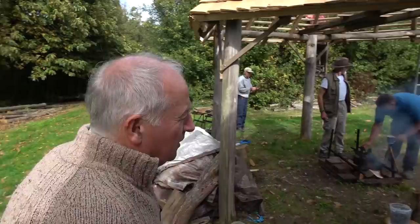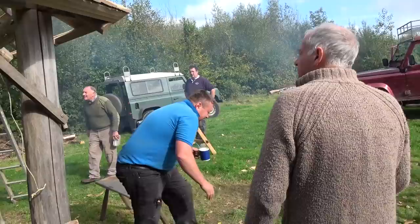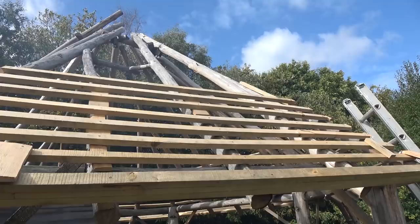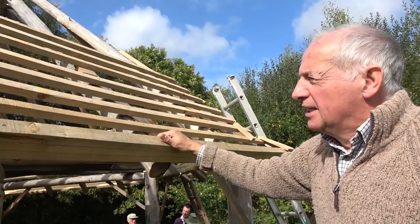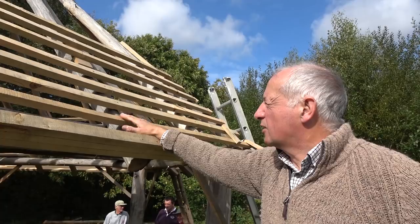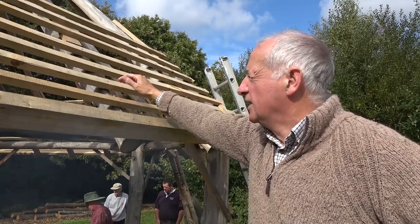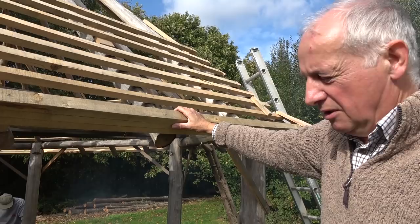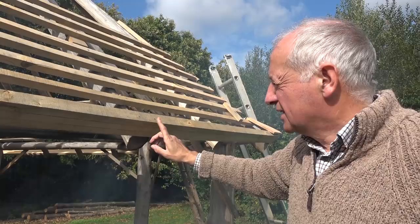If we come around here you can see the battens we've laid here — there's lots of smoke from the fire. These are laid at five inches, so five inches from the top edge to this edge here. They were cut on a wood miser and the chestnut was quite green so it did move a bit, so they're not entirely accurate. The important thing is the top edge is straight so we get a straight line to the tile. The gauge of five inches on the 15-inch shingles gives us a third cover, or three cover, at any one point.